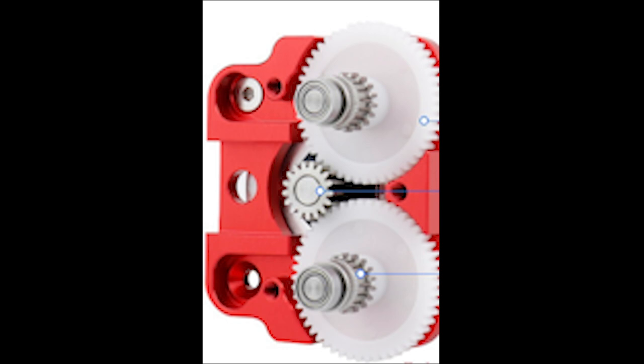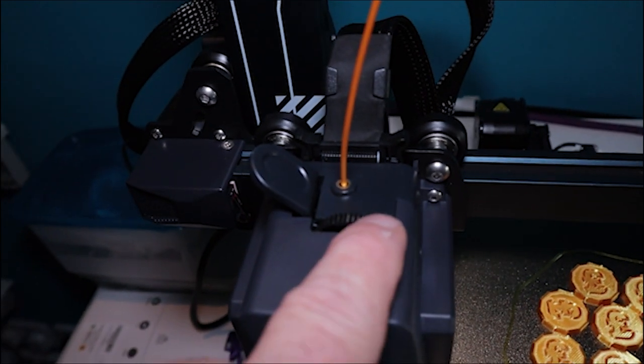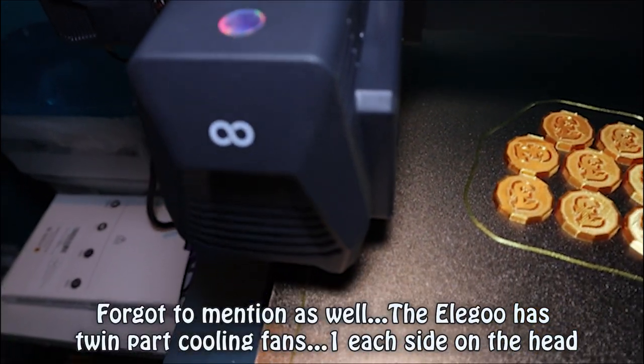This diagram shows a dual gear extruder up close. I didn't want to take the cover off the Elegoo having only just got it. As you can see, there are two gears — hence 'dual gear'. The one in the middle is what the motor drives, and the two steel bits on top and bottom are what grip the filament. So there are two wheels driving it along instead of just one. This comes as standard on the Elegoo. On the Elegoo, you pull against a spring to manually push filament through, and the front gear wheel gives a visual indication that it's being motored through.